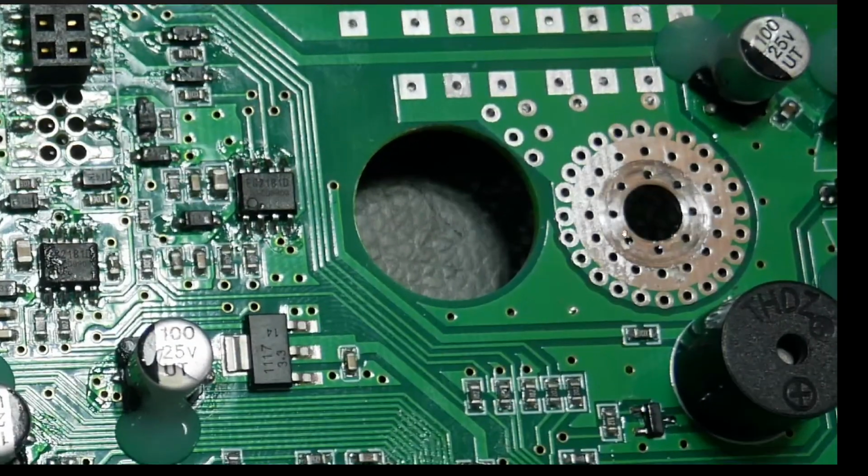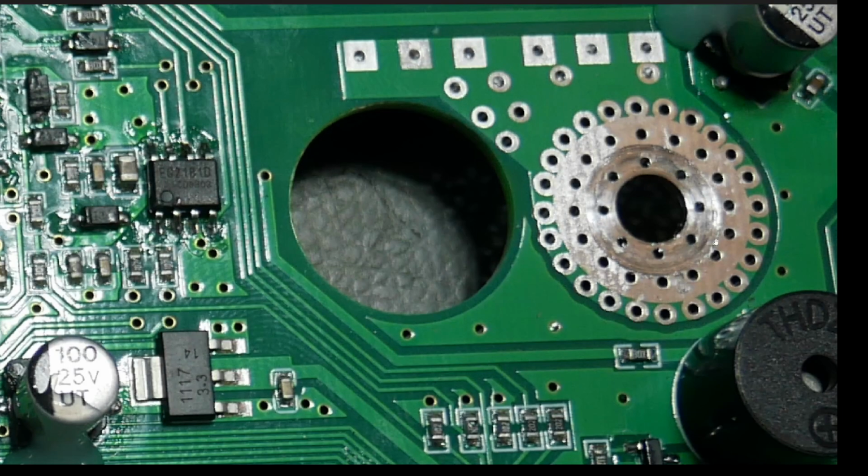On this one here, this one is nice and telling because you can see the actual denting of the circuit board, which is what you're looking at. Right here, you can see where the circuit trace pads on top are cracked away. You can see it there too. And over there, why the stud didn't shear off, your guess is as good as mine, because damn, to get the board to compress like that took a lot of serious gorilla type power on that screw to make that happen. How they didn't cam out the screw head on that one and not shear off the stud is a complete mystery, but that has been compressed really heavily. No reason on the planet to screw those screws down that tightly ever. Anyway, yeah, that was overkill in every possible way.